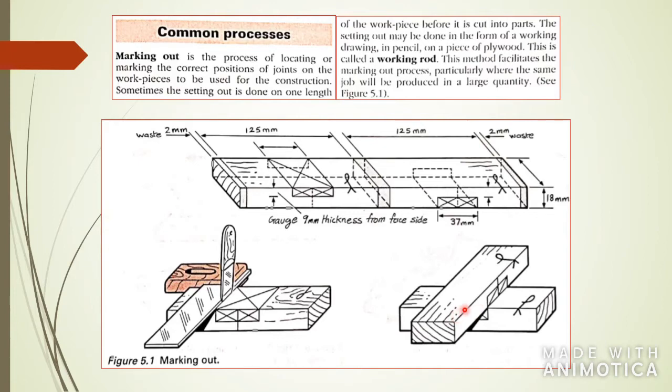This piece is a cross piece. Before you finish the cross piece, you need to mark out what measurement you want for them to cross over. Here you see 125 millimeters, and the same thing below — 125 millimeters — and you're going to cut those two to get the same length for each board. When cutting, you want to make sure you account for the blade's waste. So if you're measuring a 125-millimeter board, you want to cut on the outside of the 125 millimeters, not on the inside.